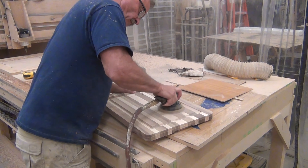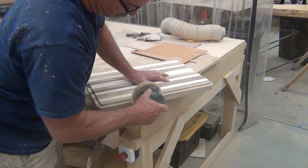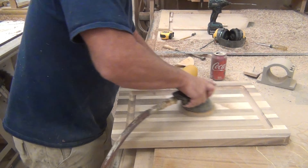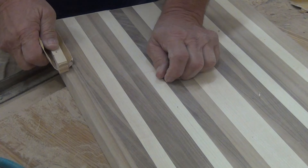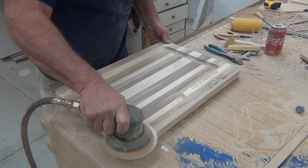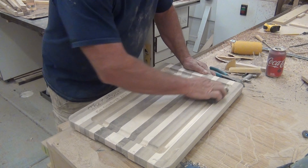Then I get to sand. There are some machining marks and burn marks that need to be sanded out — I start with 80, then eventually work up to 150. And eventually I do a nice finish with 220. Just break over the edges with the 150, use a little sanding block in the hard-to-get places, then do a 220 finish. I always finish my projects with hand sanding.